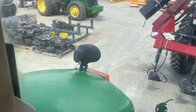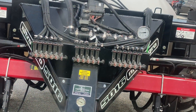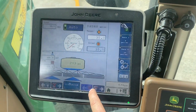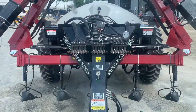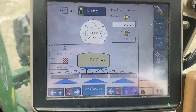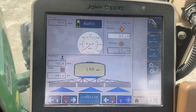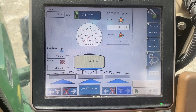The right sections are turned off — if you look, those balls are not floating. Turn it back on and now everything's turning. That is the Raven rate controller. You can have an optional pressure transducer, but this one has a real big gauge back there so we just run that and it works out just fine.